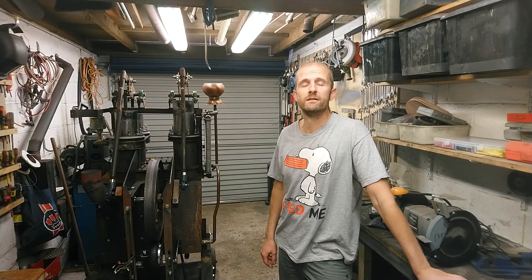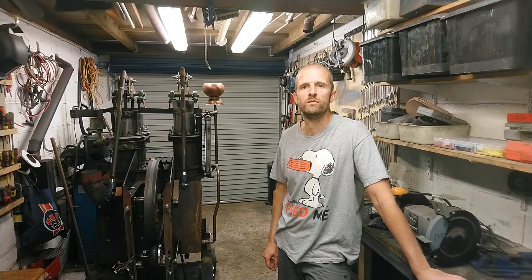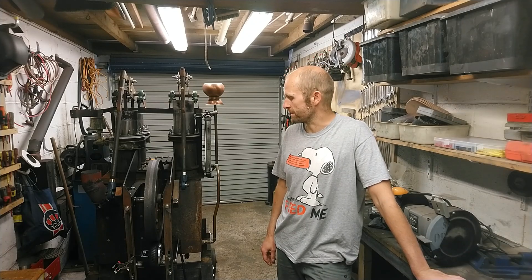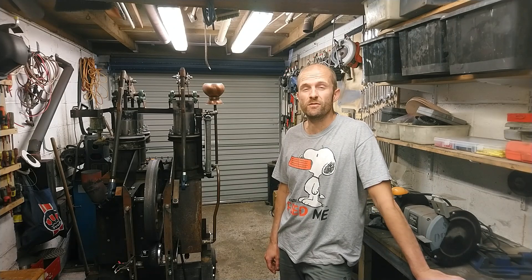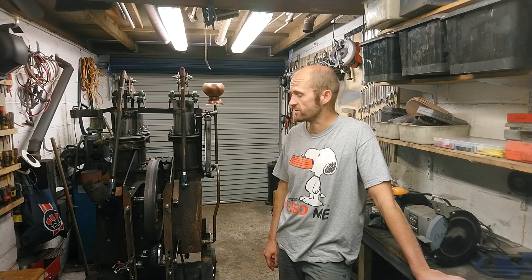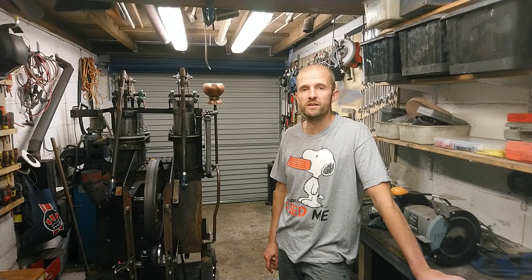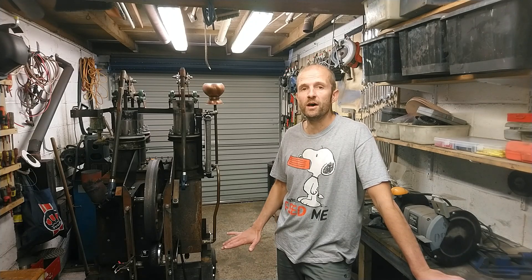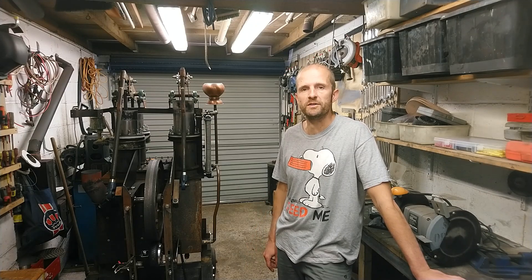Hello and welcome back. In the last video we managed to get about 150 watts of electrical power at 12 volts out of this rather big Stirling engine. We successfully used a hoverboard motor to generate power, which is quite an economical way of doing it — not the best way, but it's a cheap way. In this video I'm hoping to apply a more consistent load bank, and I'd also like to experiment with crank angles.